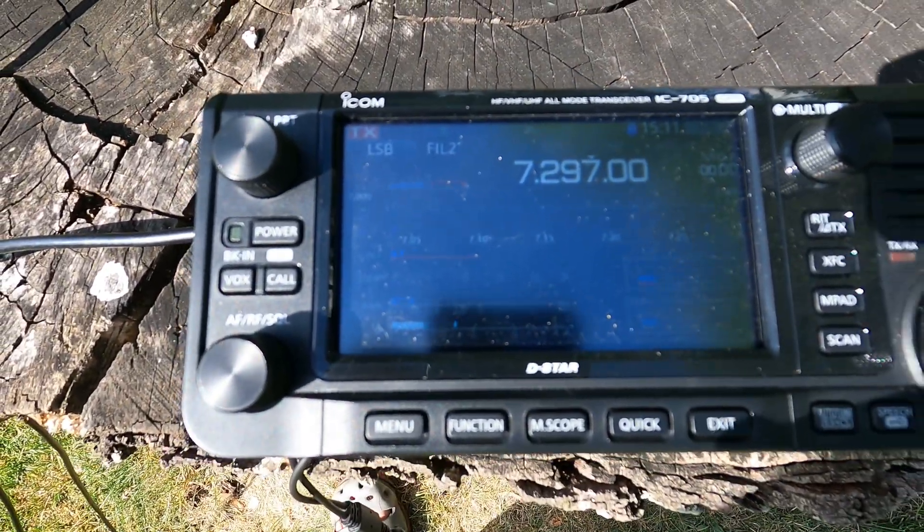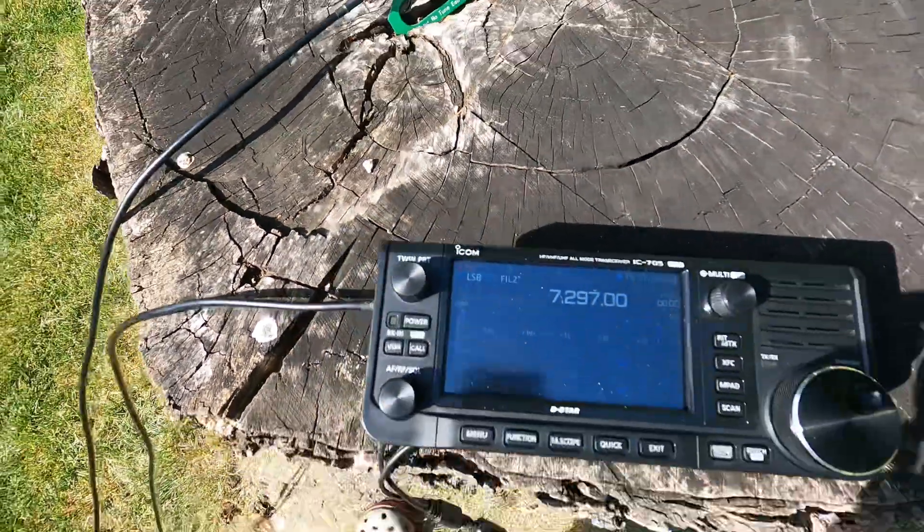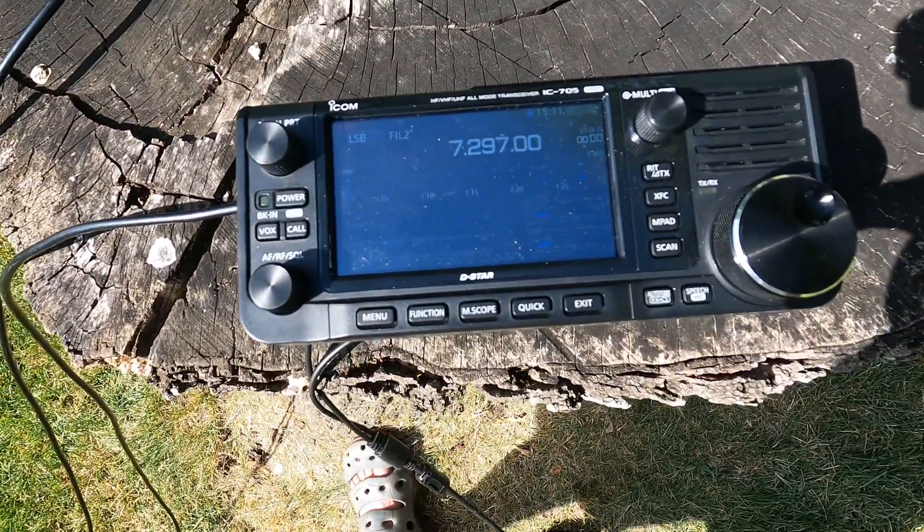KC9YBC, is this frequency clear? And I'm actually back up to 1.6 to 1.7. So as you can see from the test results, things aren't necessarily always as they seem. The same antenna, the same unun, the same position — all I did was change from a 15-foot piece of coax to a 25-foot piece of coax and I dropped my SWR by 0.4 to 0.5 points.